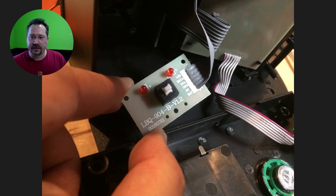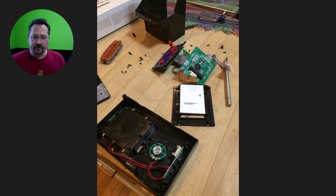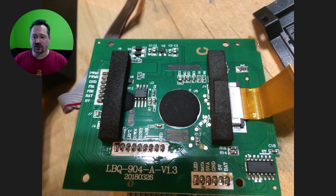However, on these boards those ribbon connectors are just soldered in place, so these parts are going to have to stick together. Right here is the main board — this is essentially right behind the video screen. What I had to do was pull out these screws to get it out, and then I also disconnected that power button just so I could pull it all out as a unit. Here, everything is out. I pulled out the control panel, and right here you can see the screen, which was just held on top of the main board. If you want to get rid of the screen as well, you can pull these two little tabs and this tiny ribbon cable will come right out.